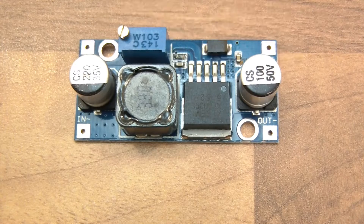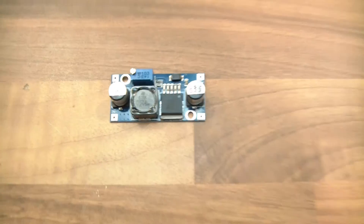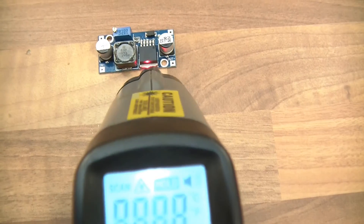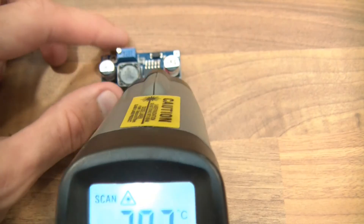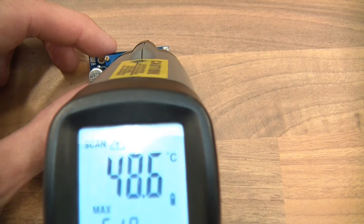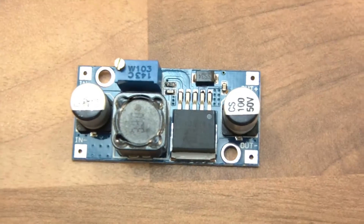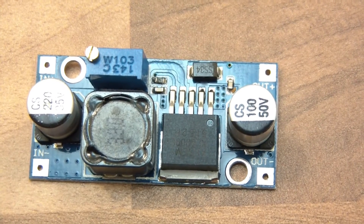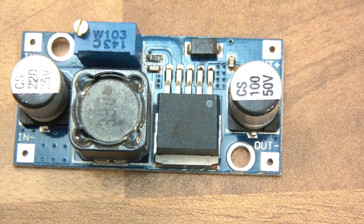So, 36 volts out and 12 or 13 volts in. Can this allow 36 volts or 60 volts at 4 amps? The answer is no, it can't. What happened is the thing just got really hot — not 100 degrees according to my sensor. The chip itself was actually okay, but the problem is this diode. You can see it's reading 48 degrees for the diode — just a second ago it was reading 90 something. So the problem is with the diode. Basically it doesn't work. This module is broken, probably because of the diode again. This module can't handle 4 amps at 60 or even 35 volts.